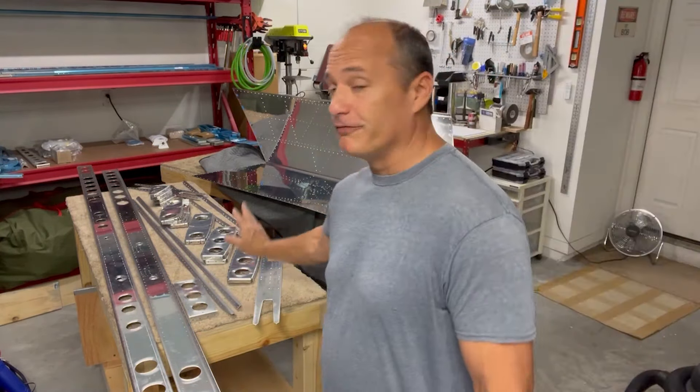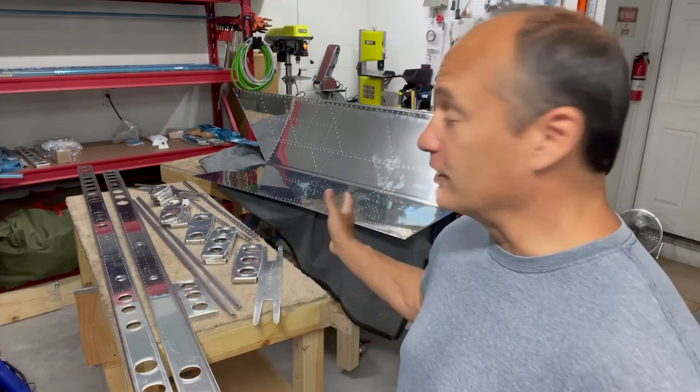While I did have a few more holes that needed drilling out than I thought, a lot of the time really got eaten up with everyone's favorite task — deburring. On the days I come out here to work on the airplane, I'm typically out here four to five hours. I spent three days last week out here, and I can easily say at least half of that time was just spent deburring holes, smoothing out edges, and fluting a lot of the ribs. The rest was the actual drilling and countersinking — which I thought I could do in probably like a day. Severely underestimated what was contained in about two pages of instructions — literally three or four steps that took me three days.